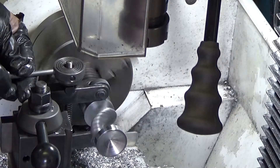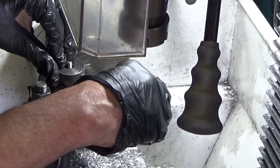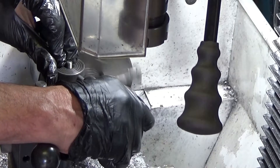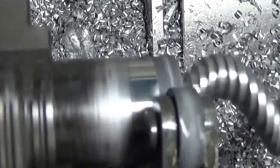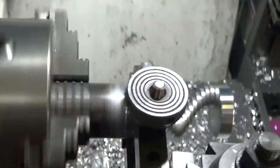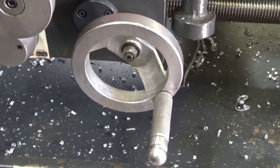The process I've found works best for me to knurl a product is to just make sure it's cutting, have it running slowly, and then gradually tighten down the knurl into the material until it looks like it's cutting okay. Once I'm happy with that, I just start the auto feed and let it feed across slowly. You can see that the auto feed is running very slowly to the left to create the knurl.